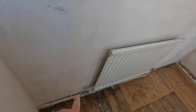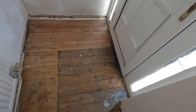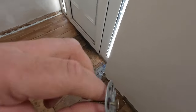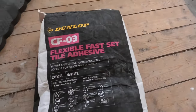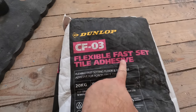We're going to use these screws and washers — we chose 25mm screws because we know the floorboards are 20mm and the backer board is 6mm, plus the washer. This way we know the screw won't penetrate the floorboards, so just in case there are any pipes or cables there, we're not going to go into them.